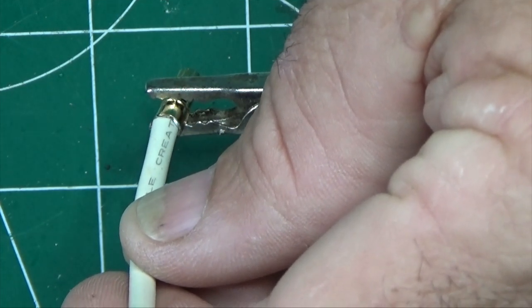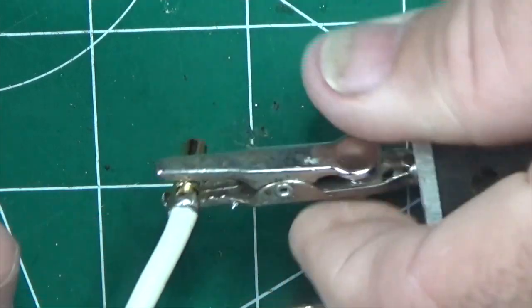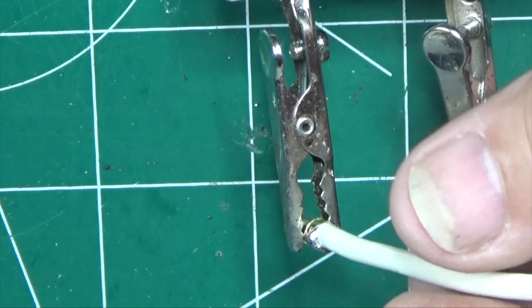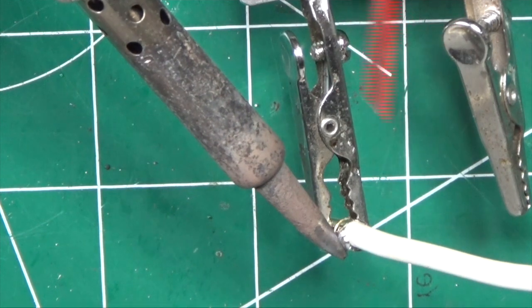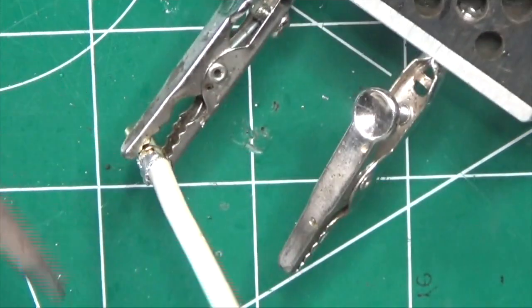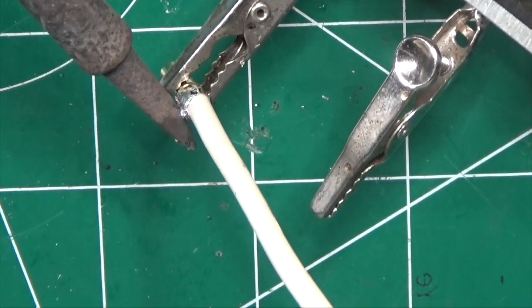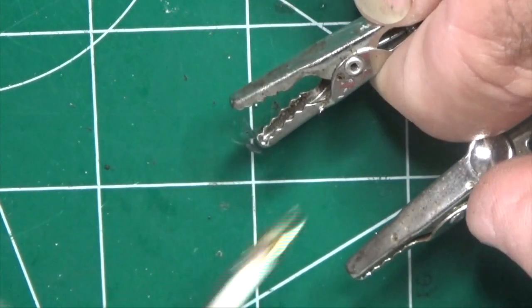Add some solder to the iron, stick it in there to get it hot again, everything's hot, stick our wire in there and hold. Wipe off our soldering iron and put the iron back in its holster. Now we can pull on this again — we can see we got extra solder there. Same as before, we can wipe it or do our canned air trick, making sure nobody's going to get burned and no items are in the path of the overspray. Sometimes the solder wraps around the connector, so wipe it off.